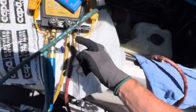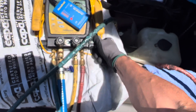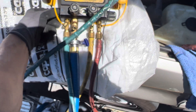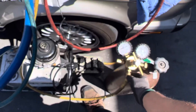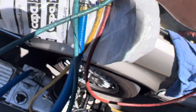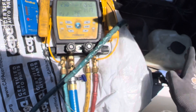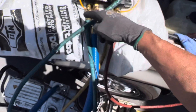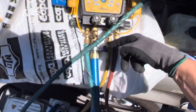I'm going to bleed out the nitrogen through the low side, then close the low side. I'm using the nitrogen as part of a cleaning process to reduce moisture content. I'll open up the low side and turn off the nitrogen, then disconnect the air. Let the pressure drop — I'm not removing it from the high side; I'm letting it bleed through the high side, through the expansion valve, through the evaporator, down the low side line, and out to atmosphere. Open it up all the way, then I'll turn my vacuum pump on.